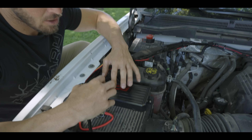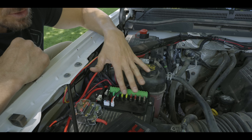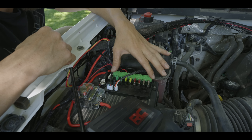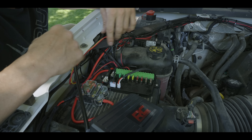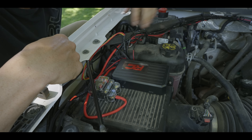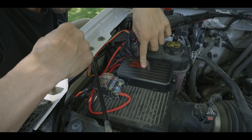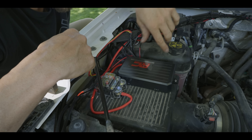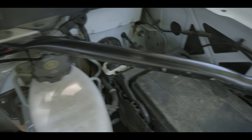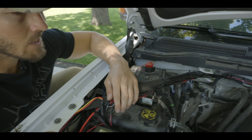This is basically the brain for the switches. What we've got here is positive and negative coming from the battery into this box. You have all these fuses, all of the lights come into this bus bar. You've got fuses for all the lights, wiring for the controller, and it keeps everything nice and clean and simple. This is a 60-amp breaker for the entire system — running from your battery, through here, into this box. If there's a problem or a short, this is going to pop and you're not going to fry any of your wires.